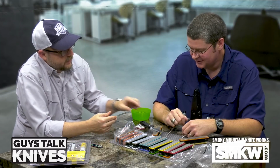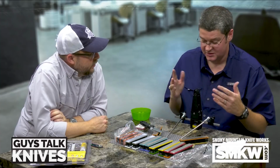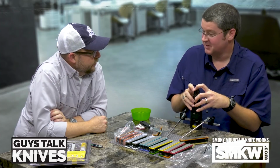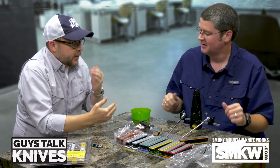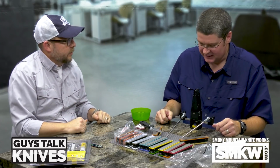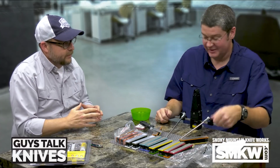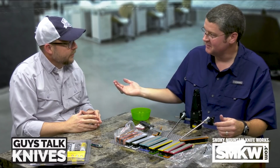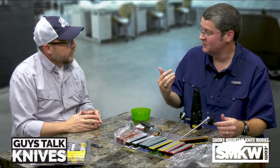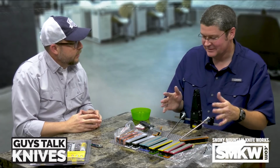That's very nice. So that's basically how you sharpen. And whether you're using the Cadillac, the Ford, or loose stones, it's all the same process. And it's practice. Get 4 or 5 Rough Riders and dull them. Keep one that has a good edge that comes from the factory, and then just try stropping it and using it. And the best way to figure out if you're doing this right is kind of like golf.